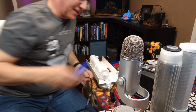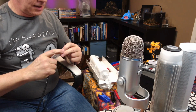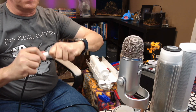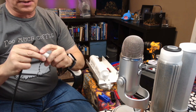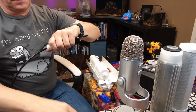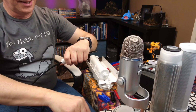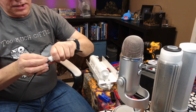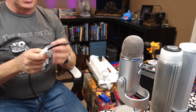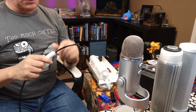I'm going to cut this piece of tubing right here with a tubing cutter. Super convenient. I am going to remove these little blue retaining clips right here and push my tubing in. And then this side over here as well. Then when you pull slightly, if you don't drop them, you can put the little blue clip back in place. The retaining clips are not mandatory, but they sure are nice, because they avoid a hose popping out.